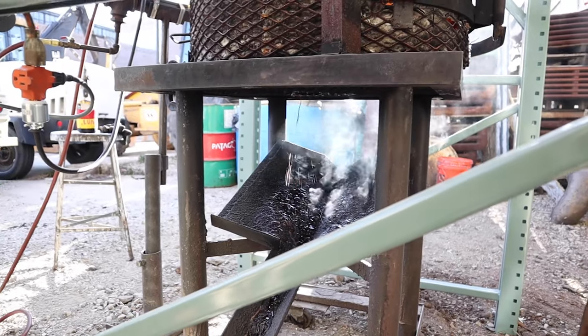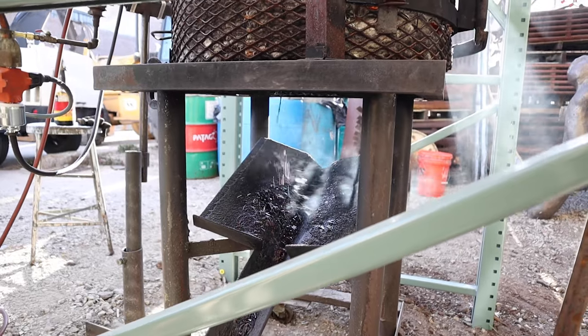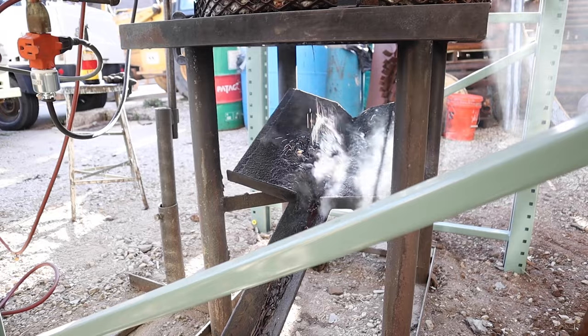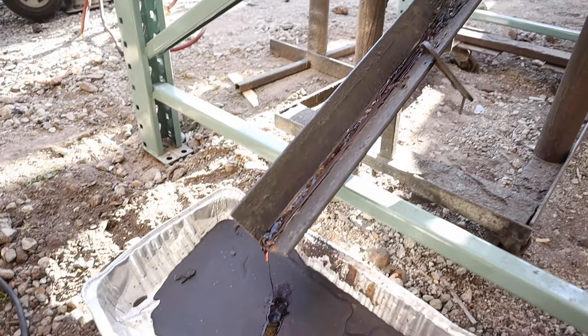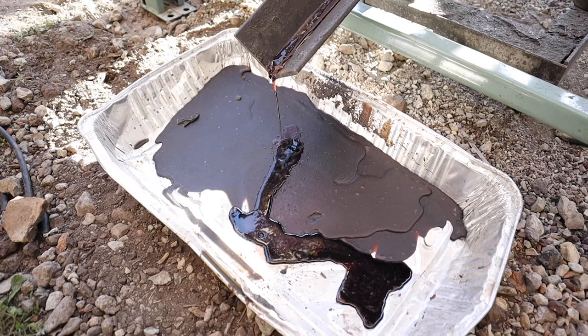Yeah, so now you can start seeing the wax dripping out already. I created some wings on the side of my angle iron to create a little bit bigger target. And then it just drains right down here to the trough and draining into the cake pan where I can collect it